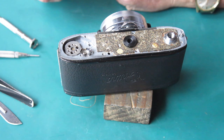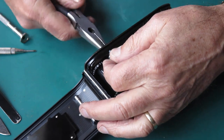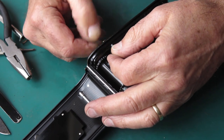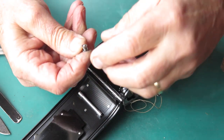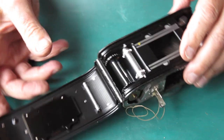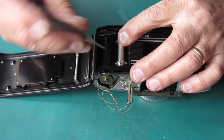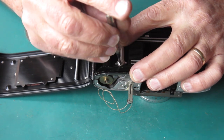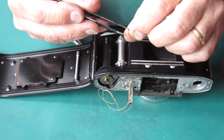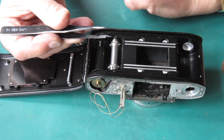The rewind button I want off. I have a pair of suitably mutilated pliers that'll grab that rewind knob. That's very tight on the thread. Corrosion is usually the main reason for things like that. Looking at this — no, it doesn't look particularly bad. There's a thing here that drives the sprocket from the sprocket shaft. We'll take that screw out. That screw — it's got something on it. Here's a film chip — we've just had a camera crippled by film chips. Take out the shaft, take out the sprocket.